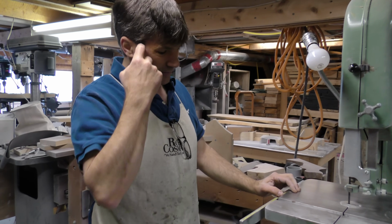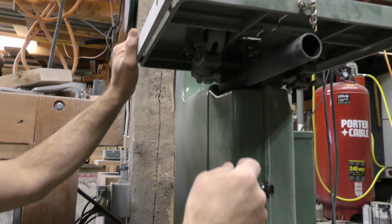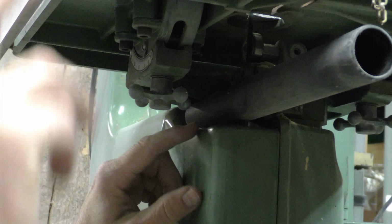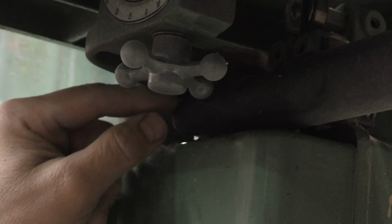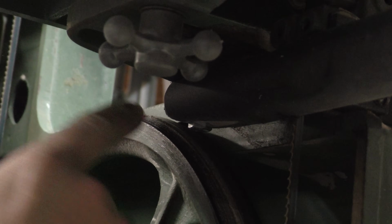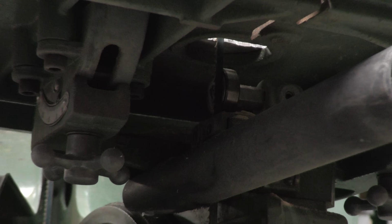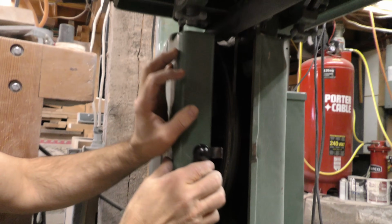Now, this is a smaller machine, but same principle. If you look underneath here, this one is a little more permanent. I took a piece of vacuum hose, that's the narrow stuff. I turned on the lathe a plug that filled this back end about 2 inches and cemented it in place, and then cut it off flat so that I could bore a hole up through that. I think I bored a hole in this cast iron frame as well and put one bolt and nut in there, and that holds the whole thing in place. Now I've got this relatively clean inside, so I'll hook this up.